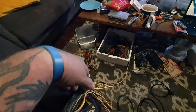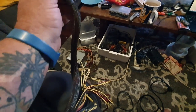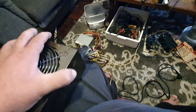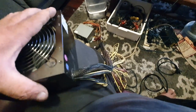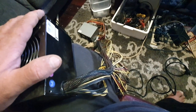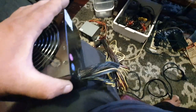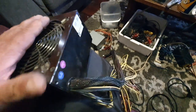And just don't forget, you need the green wire, which I'm pretty sure is in here, and the green wire with one black. That's all you need. The machine will not turn on without that green wire connected to a black. Black is, I'm pretty sure some people say earth, some people say ground. So, okay, I hope that helps for some of the people who have wondered how to get a power supply happening. And if you're not sure, I'll put a link in the description to a particular video that I found very useful in how to set up a supply. But I don't think you need it. I'll just put it there in case.